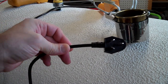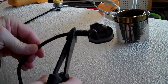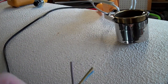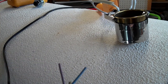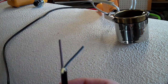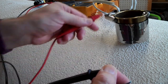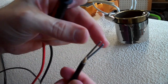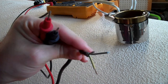I'm not planning on using this old plug for anything — I'm throwing it away — so I'm just going to take as much wire as I can get. The actual colors in here are a yellow with a green stripe, blue, and brown. I'm going to guess that yellow with green stripe is earth and the other two are the hots, but let's check that. After stripping the yellow and green, we have confirmation that is ground, which means these are the hot and neutral — or hot and hot in the US split-phase system.